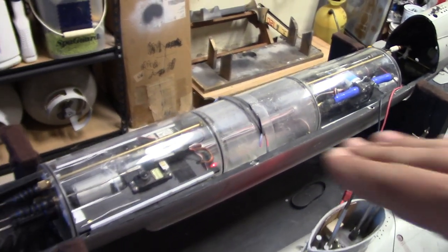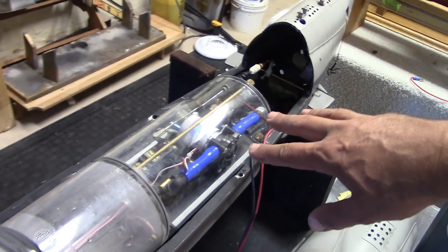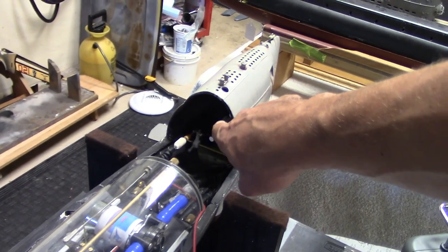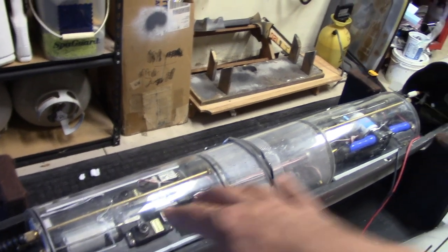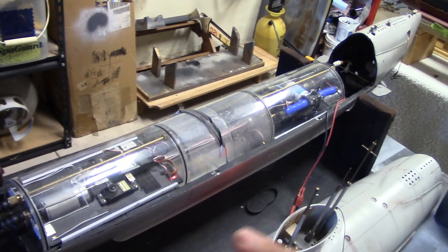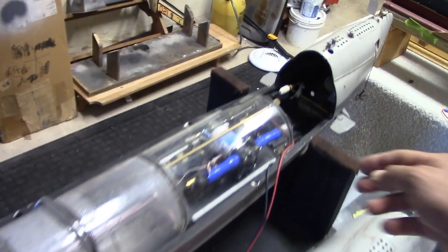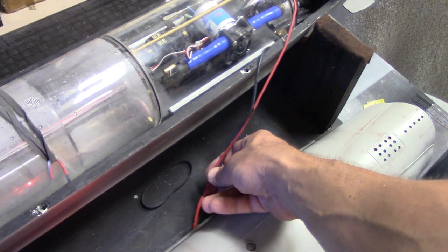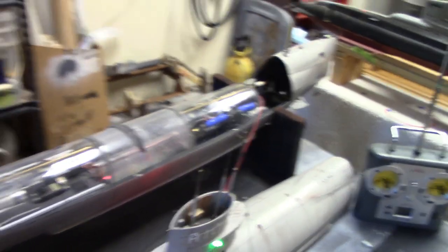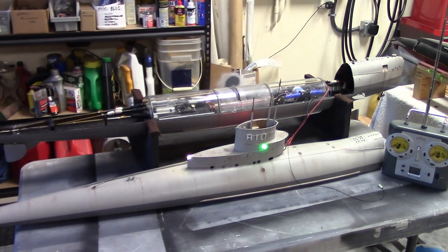The only other thing I'm going to mention, the other modification that I did: typically with an OTW cylinder, you would have a battery, and in this case, it used to be mounted in the bow, like a big sealed lead acid battery. What I did is I put a big 3,000 or 3,300 milliamp lithium polymer battery in the cylinder itself. So it is completely self-contained, no external connections at all, and I repurposed the original battery connections as the LED wiring connection. You can see that right there. So a nice, simple, reliable, and exceptionally good operating control system for this boat.